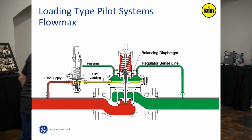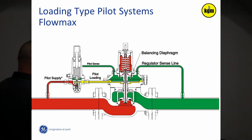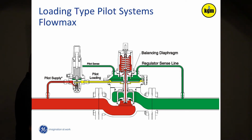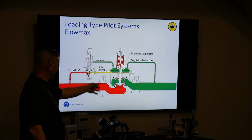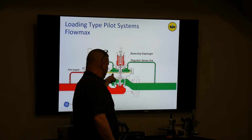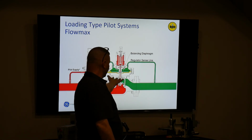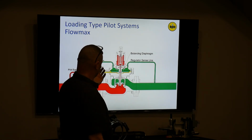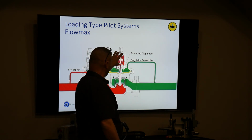All right, well, this is on the wall out there, by the way, too. This is a little bit deceptive because obviously this supply line is in the body, and it's coming out of a pilot filter, but it passes through the pilot, goes basically straight into the area underneath that diaphragm plate and the underside and lifts the assembly. You can see the assembly with the various O-rings and that mainspring I was describing, and also the hollow shaft that's putting inlet pressure up there.